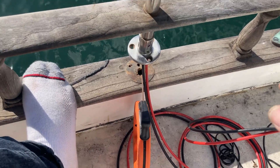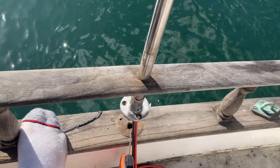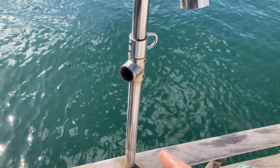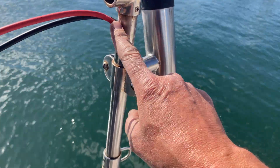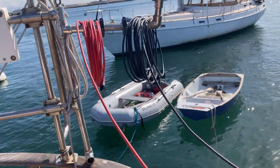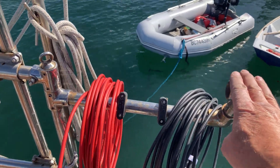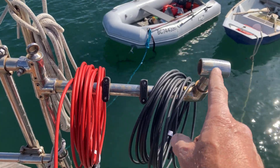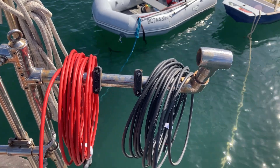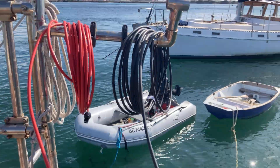I was able to get the solar wire actually through the stanchion. I was able to force it down directly without needing a messenger line — actually the messenger line broke off. In order to feed it through I needed to uncoil the line, so I jury-rigged a little line reel. This is actually a piece from what used to be some sort of a barbecue stand that was on the stanchion on the starboard side. I hacked that to make a little line reel to make things a bit easier for myself.